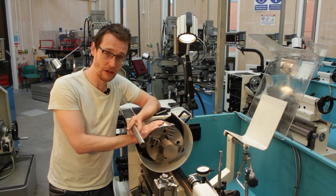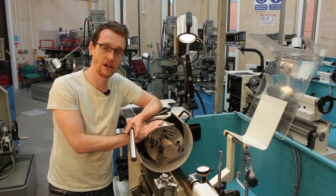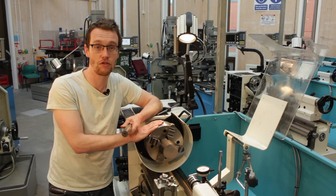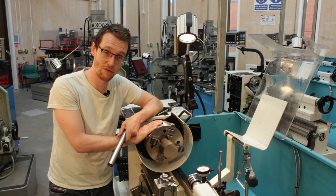We're going to compare this in a four-jaw, a three-jaw, the collet system, and between centres — so we can make a comparison in terms of runout and accuracy, and also how long it actually takes to set up. Let's start off with the four-jaw.